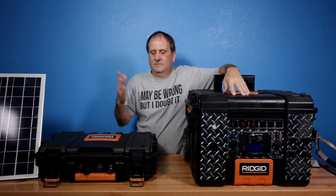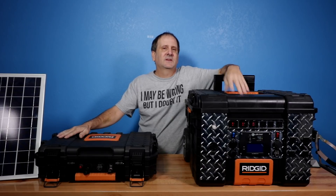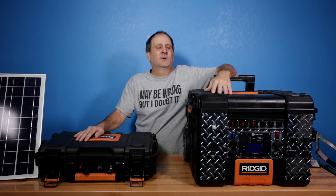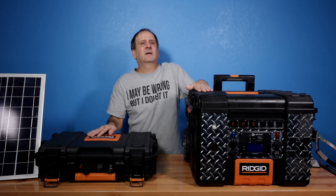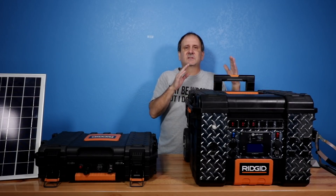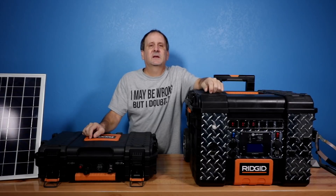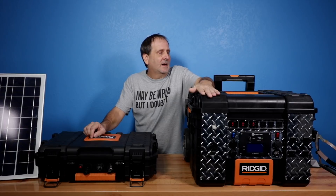At the end of the day it's 600 watts continuous and 1200 watt peak for a millisecond — great for tailgating, cookouts, camping, very simple easy portable power. Whereas the true 3000 watt continuous output low frequency unit with the 9000 watt surge for 20 seconds is more of a whole home backup generator. You can continue to add more batteries to these units, stack the units together and they'll work simultaneously, and we also have other battery banks, battery cells, and power walls coming soon to the website.